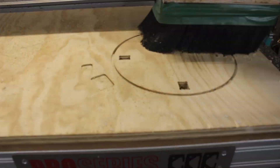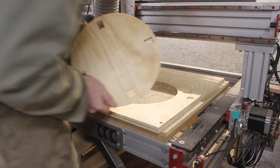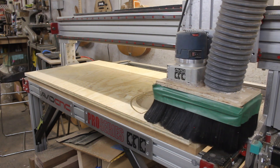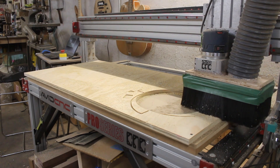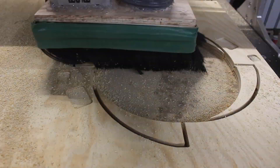Because I had stacked some usable parts together by having the stool fit inside the foot ring, I thought I would have to take the stool top out before running other paths, so I ran a separate toolpath and cut that out first and then removed it. On my first one I found that wasn't actually necessary — you can just run all the files at once and set it and forget it.